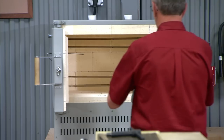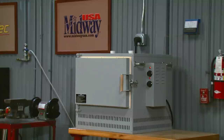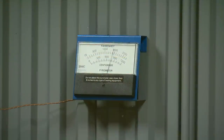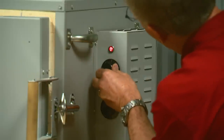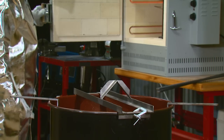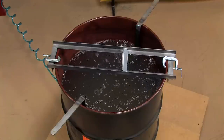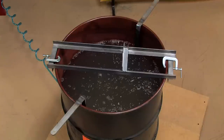The crucible is placed in the furnace and the thermostat is set on high. Once it reaches 1425 degrees, I'll lower the thermostat to 1250. When the temperature comes down to 1250, I leave it there for another hour. Then the crucible is pulled from the furnace and the parts are dumped into a barrel of water that has been aerating for about an hour.